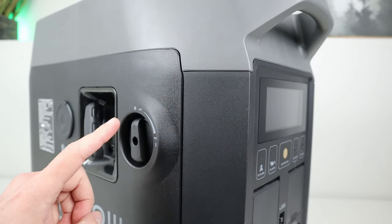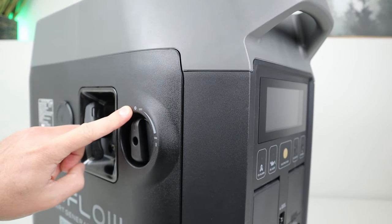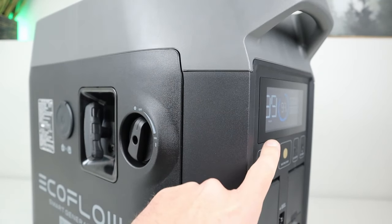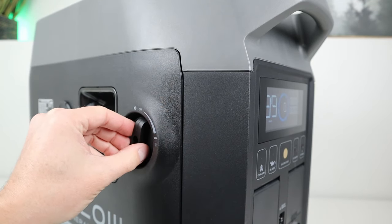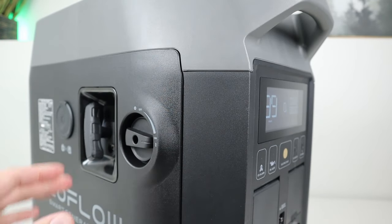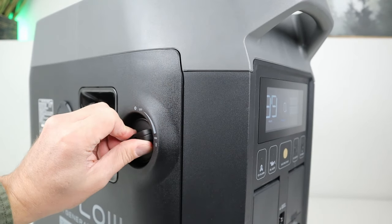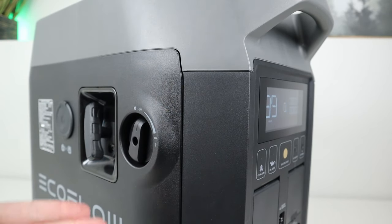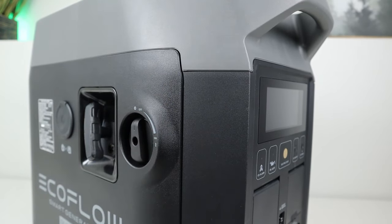This switch controls the battery and fuel shutoff. At the top position it's in storage and both are off. Turned slightly, it turns on the battery and the display becomes active. Turned all the way open activates the gasoline fuel valve — that's where you want it when running on gasoline. For storage, turn it to the first off position to shut off fuel, let the carb run dry, and then flip all the way up to turn off the battery and display.